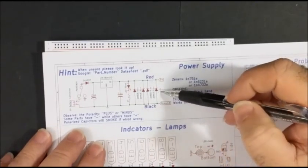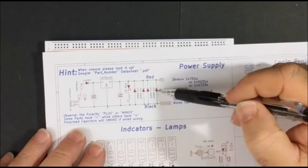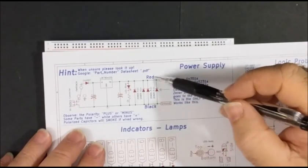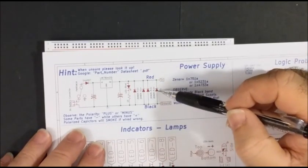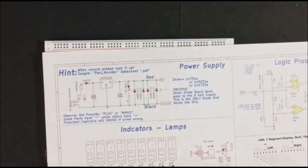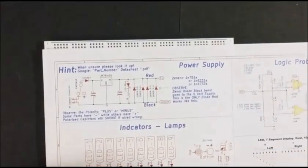So these hopefully will never turn on. If you were to take your battery and hook it up to the 5-volt rail, these are what will protect your circuit. Also, if you hook your rail up backwards or hook the battery up to it by accident and backwards, these will protect your parts from going poof. I'll talk about the genie — the true story of electricity — in one of the next videos.